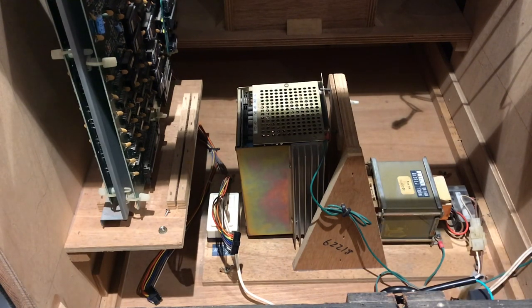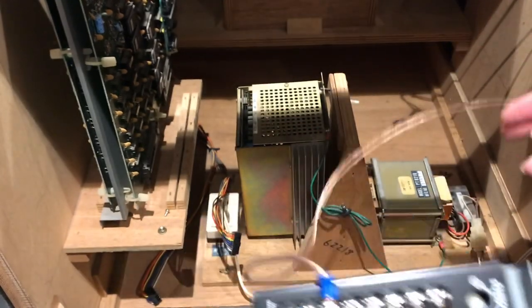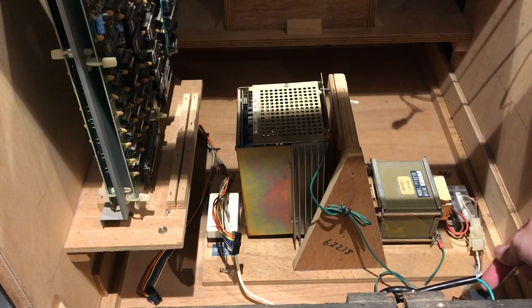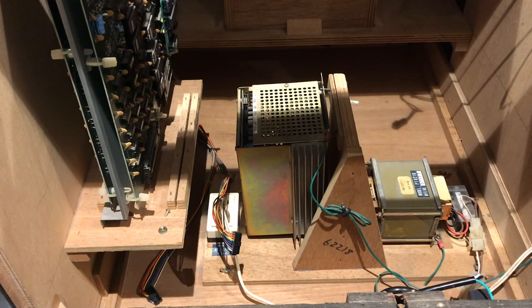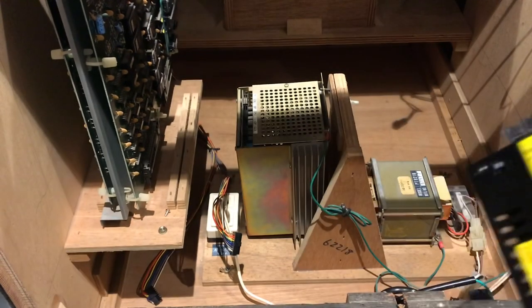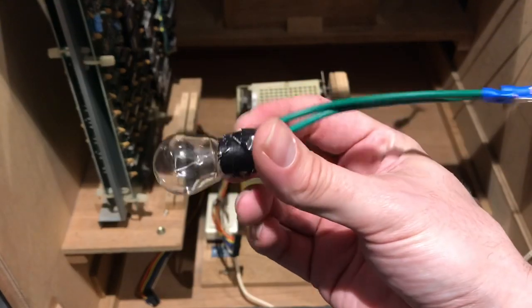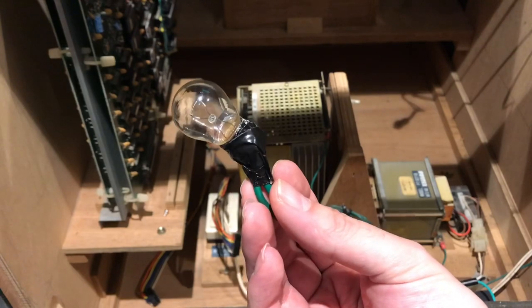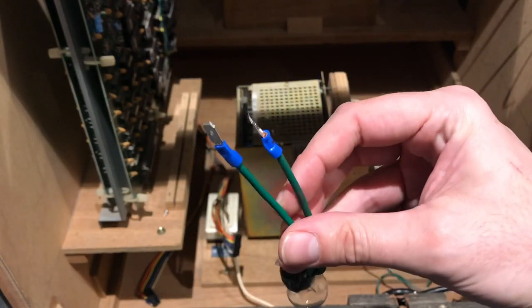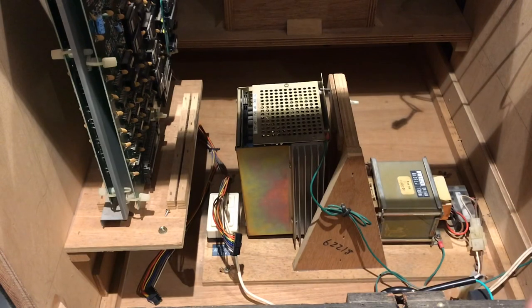What I've done is added a field ground wire - I made this myself - just to put on to the incoming mains ground. There is a ground here already on this bolt, and I intend to put that on the casing to ground it to the casing. I've also made a 12 volt indicator light from my car with two wires on it, with correct polarity, so we can test the power supply under load.